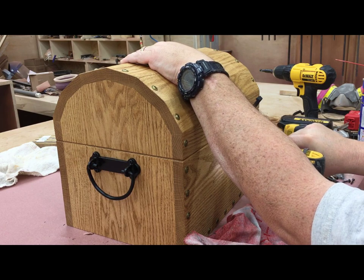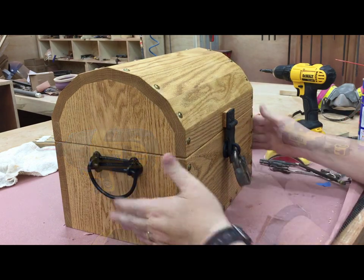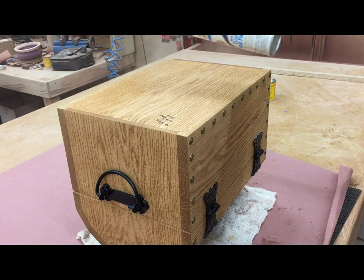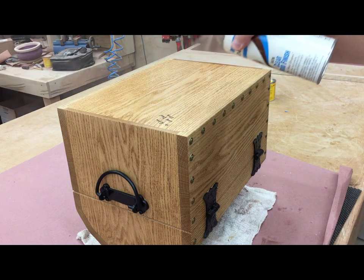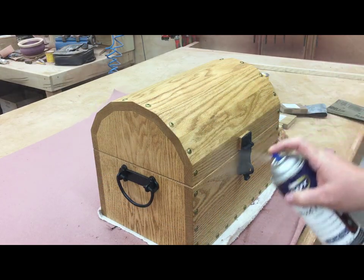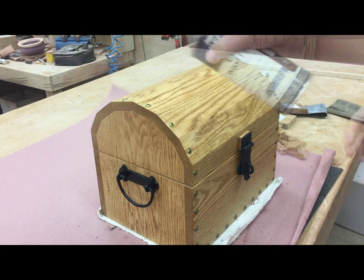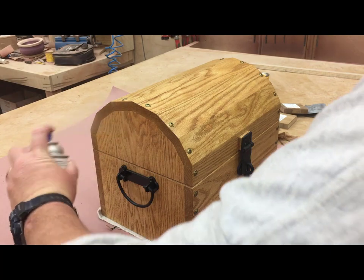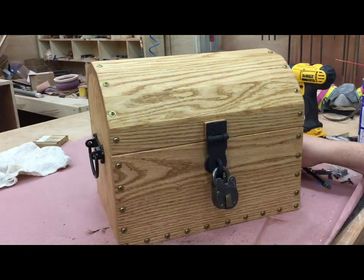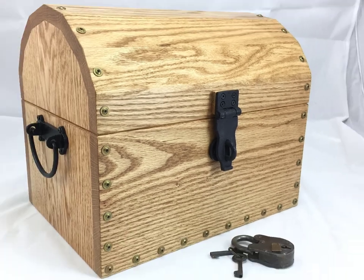Once again I use a VIX bit — a self-centering bit — to perfectly center the screw holes. A quick spray of air to blow the sawdust out of the holes; we don't want the holes so tight that we have to put extra torque on the screws to get them in, as this might risk breaking. I've got to make sure that lock works so that I know we can store our gold safely. For the final top coat I like to use a satin lacquer finish. If the project is large I have an air compressor and sprayer, but if it's small it's a lot easier just to use the individual cans — Deft makes a really nice product and it's the one I use most. I put about four coats total, sanding between each coat, starting at around 400 grit and ending up at about 2,000 grit. And that's it — one completed pirate's chest, ready to be filled with gold. Thanks for watching and if you enjoyed the video please consider subscribing to my channel.